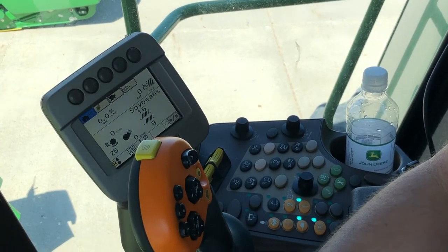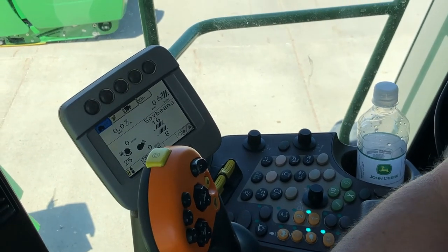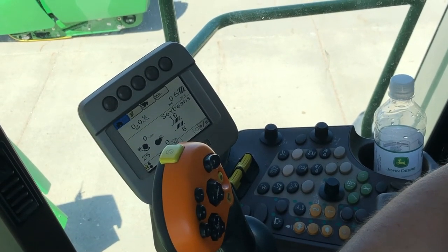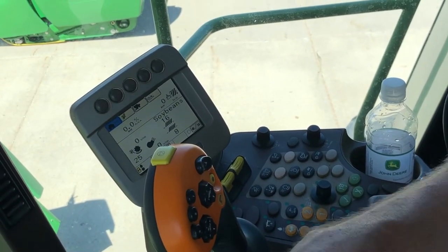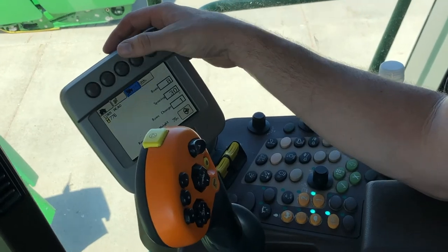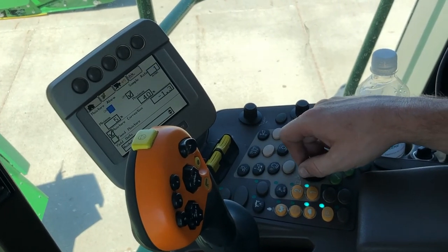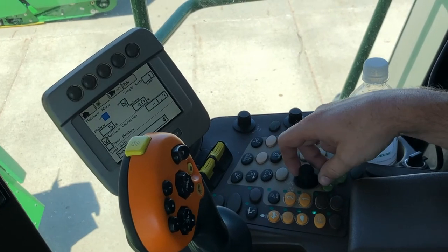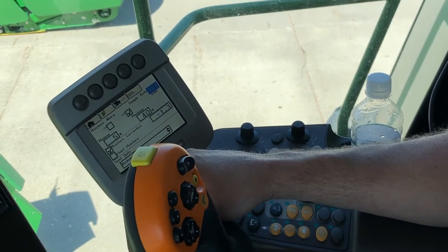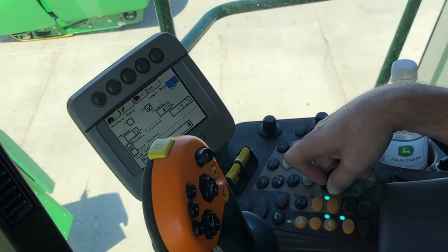The next calibration we're going to go over is to calibrate our moisture. So if we are reading on our combine that we are in 15% moisture corn, and we go to the elevator and they tell us our corn is actually 17 and a half, I'm going to show you where to go in and adjust that on our 70 series command center. We'll hit the button above the combine about four times and that brings us to our moisture page. We can use the scroll wheel to scroll. If you want an alarm on, you can turn that on by hitting the check mark, and then you can turn on your maximum or minimum values. The sample rate — typically we'll do it at once a minute just to save the life on that plunger and that moisture sensor.